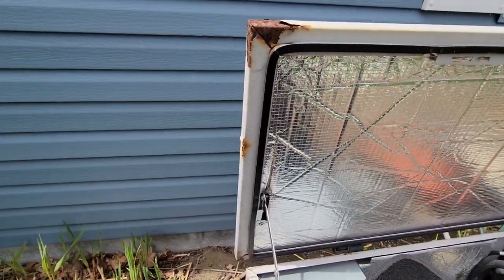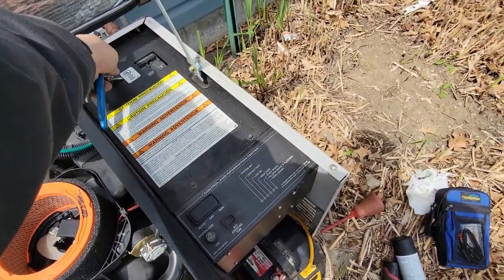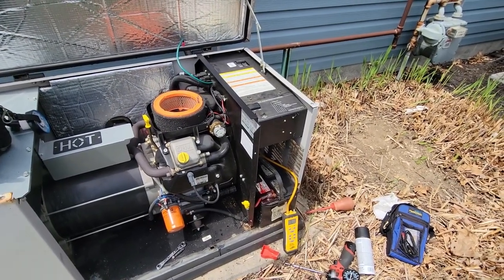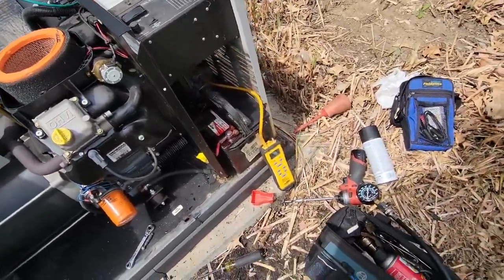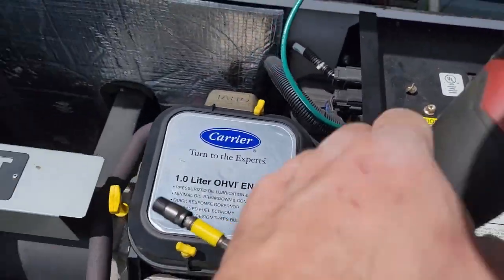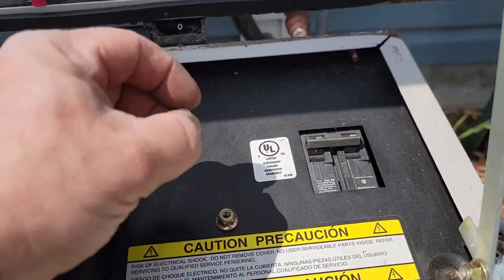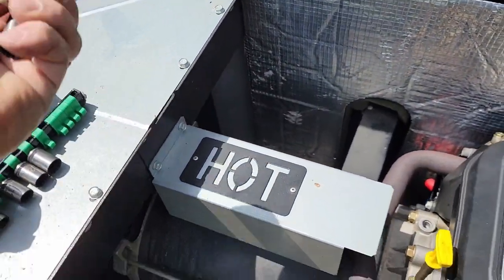You can see how well this chassis is holding up - it's all rusting out, which is the reason they went to aluminum now. Let's pull this top off - it's all metric, so you HVAC guys used to standard are going to have to pick up a metric set. I'm going to recommend we replace the fuel regulator even though it's going to start and run just fine for them. This one has no dates or maintenance history on it whatsoever. Let me grab my seven millimeter here - it's one of those universal ones that can do square drive and all that. It really gets in there with the ten millimeter universal swivel socket.